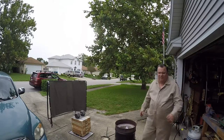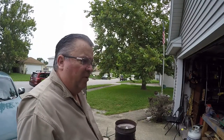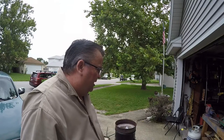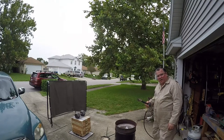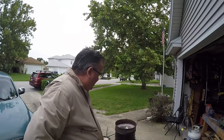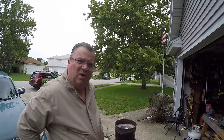Now another thing is that I got my new burner in here. Instead of using the Harbor Freight, what was it, more of a burner for burning weeds and such, I actually plopped down the bucks to get a proper propane burner, not jet burner. And this is basically what it looks like. Now, in theory, that burner is going to be able to give me a hot enough flame, not just to do aluminum, but also to do brass and bronze, if I ever find scrap brass and bronze.